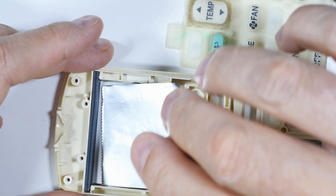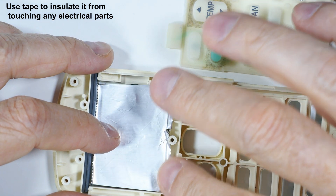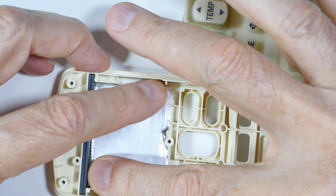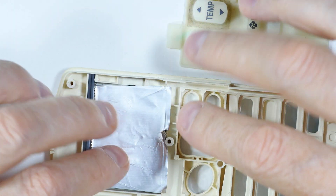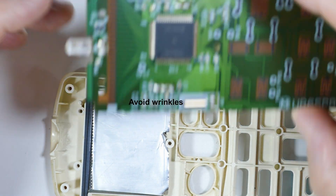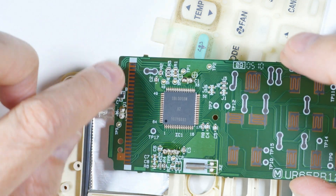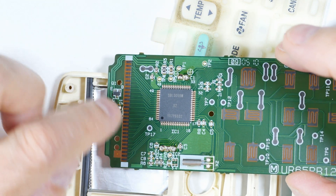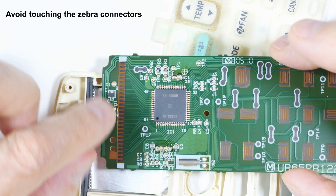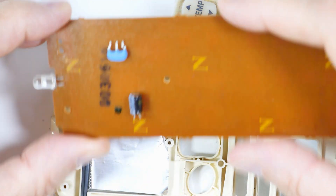What you can do is take a piece of aluminum foil that's carefully cut and set it on here. You may need tape or whatever to hold it in place. In this particular remote it'll just stay in place because of the circuit board. Smooth it on there as carefully as possible and get it flat. If there are segments dropping out on your LCD screen, you can clean this carefully with a soft eraser — and the same with this side. Don't get carried away or it will ruin it.